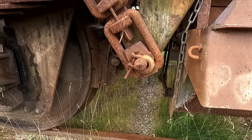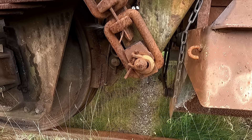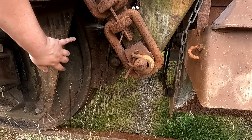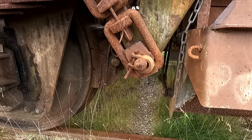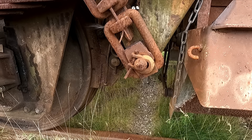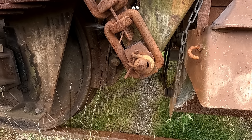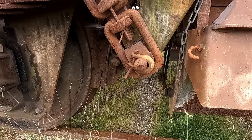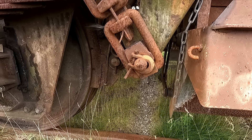In the older days, you started with vacuum brakes. Vacuum brakes worked by adding a vacuum behind the brakes to pull them away, and then you remove the vacuum to engage them against the actual wheels. Now we use air and hydraulics — hydraulics isn't as common here, but it's a thing worth mentioning. They work just like your car brakes, so they're very efficient. Air is slow to move, and that's actually what leads into the next thing.